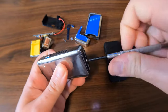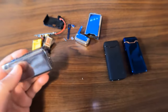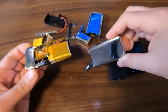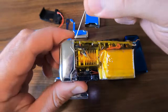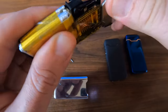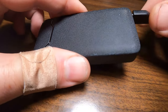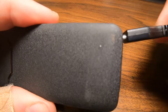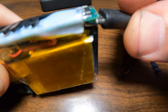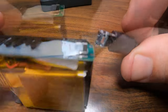I have had some problems with them, unfortunately. To explain, I'll give you a teardown to show the internals. Just one screw on the bottom and the cover slides right off. Two plastic pieces for the button and lights will fall out. The cap assembly is held in place with this pin; after you remove it, the other side pops right out. The first problem was entirely my fault—I kicked the cord while it was charging, whipping it to the ground and breaking the charging jack loose. Turned out to be a pretty easy fix, though. Just held it in place with an alligator clip and reflowed the solder with a light touch from my soldering iron.